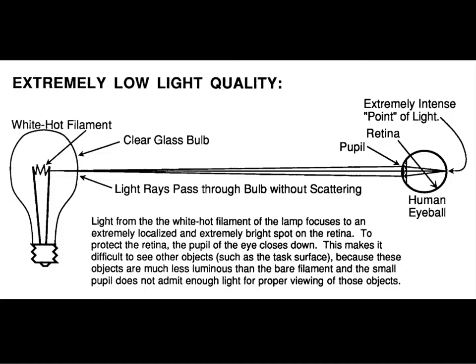The first example using diffusing glass in the aperture — in fact all of these examples will be represented by a very familiar analogy. If we take an incandescent lamp which has two wires and a tungsten filament that glows white-hot, this is surrounded by, in the old days, a clear glass — you can still buy these under some circumstances — and this is an evacuated volume that keeps the tungsten filament from burning up.